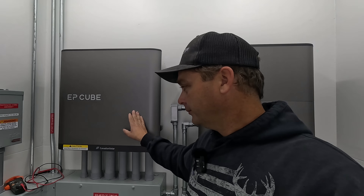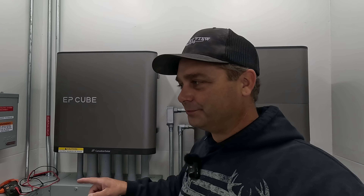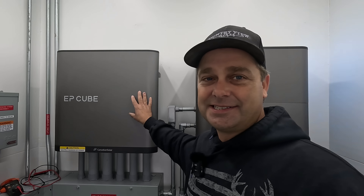I tried to get the solar power system to accept the generator, but it has a very narrow frequency band. I had the generator running a little high and it wouldn't switch over, so I had to dial it in between 59 and 60 Hz. Even when it did switch over, as soon as I put a heavy load on the generator, the frequency dipped and the solar system detected that drop and switched off the generator.